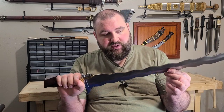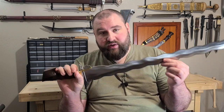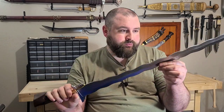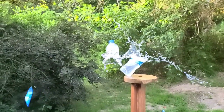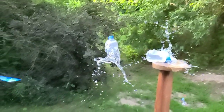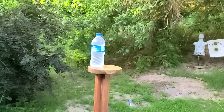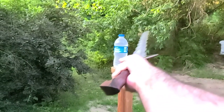What makes this such a good cutter, in my opinion? For one, it is quite sharp. It is not razor sharp — typically you don't want a razor sharp edge on a sword for durability purposes — but it is really sharp. Even running your finger across it, you can tell that it wants to bite. The other thing is the edge geometry is quite good, and the blade geometry itself is really good. It's a very slim, very narrow blade that just slips through targets really easily.